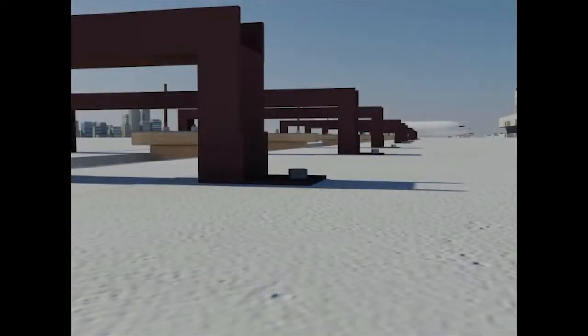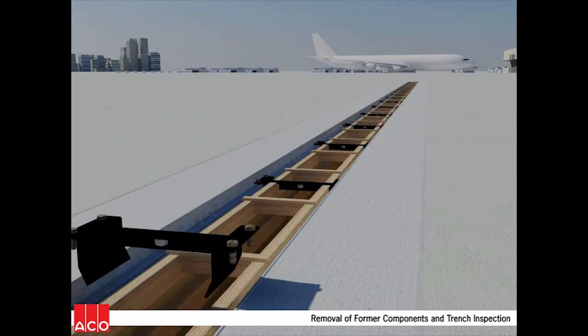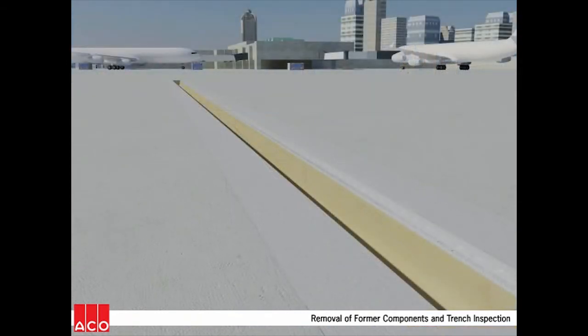The deforming process involves only a few simple steps: removal of the hanging devices, removal of the crossbars and wood bracing, and finally removal of the fiberglass forms themselves. All of these components are reusable, so they should be set aside and protected.